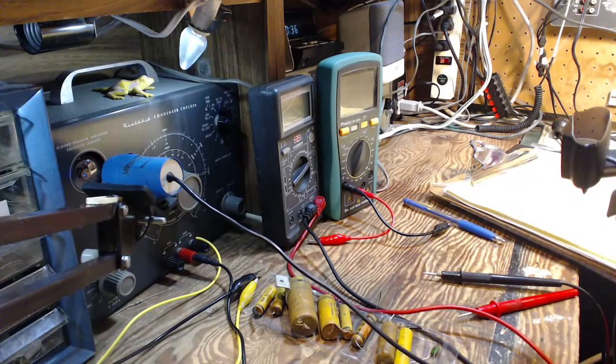Now, this voltage thing. There is a voltage that appears in capacitors that comes from the dielectric material inside the capacitor. You might think of the charges as being on the plates, but there's also something going on in the dielectric, which plays a huge role in the charge that can be put on the plates of a capacitor. And the dielectric material in these capacitors is basically paper soaked in oil or wax or something of that sort.